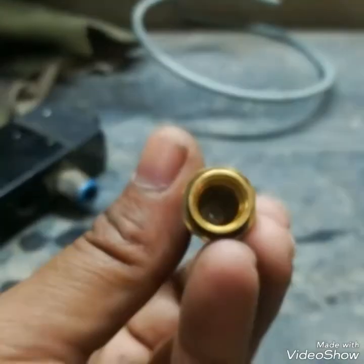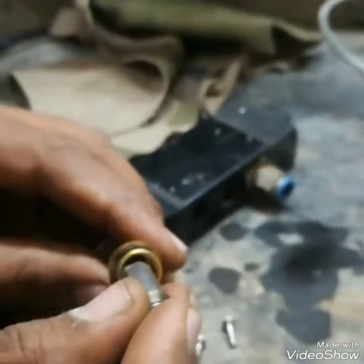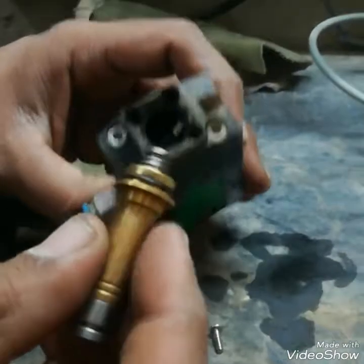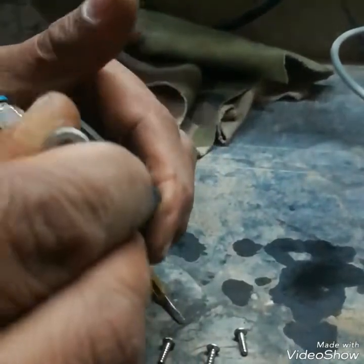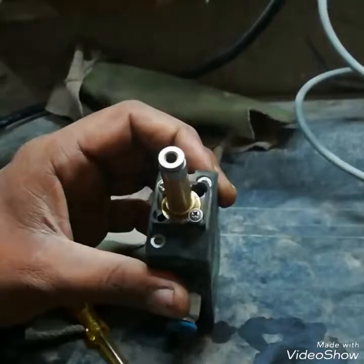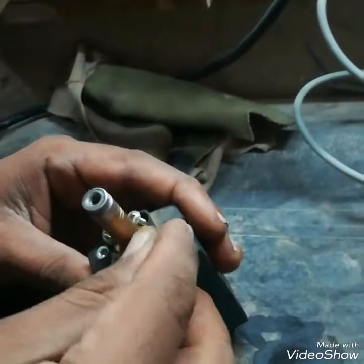The core has a metallic body with a hole — this hole is very important and must remain open. The o-ring here is also important; there should be no leakage. I am now fixing it back. So I have shown you what is inside an SOV, how to repair it, and the main causes of failure: moisture and dust.